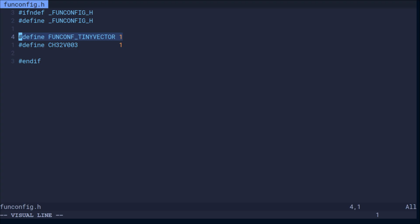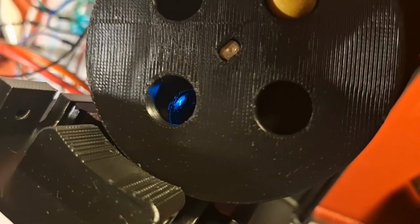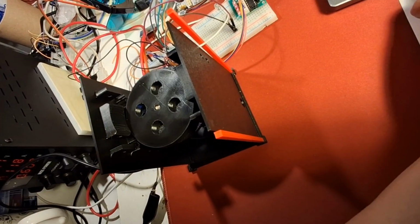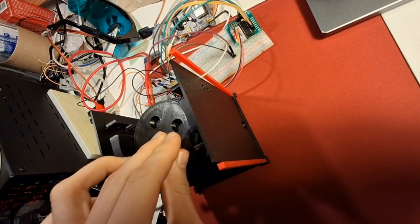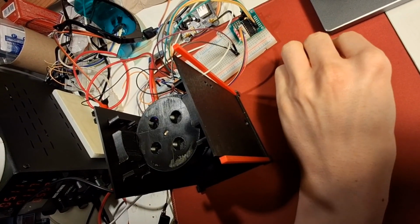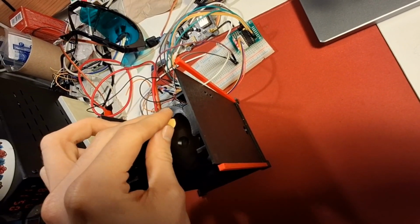Then I got the idea to look into the config file, and there it was. For some reason there was a setting which disabled any use of interrupts. So, after changing that, timers were finally working. Well, next time I will make sure to first check the settings and only after that try something else. But in the end I was happy that it was finally working.